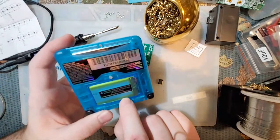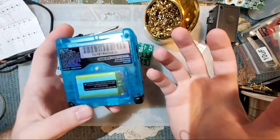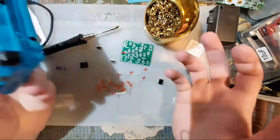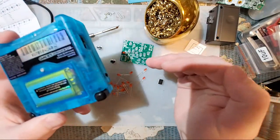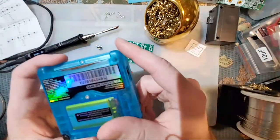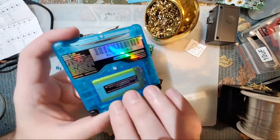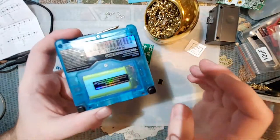Some battery compartments are just a little bit smaller than some of the others. It's a thing in manufacturing, and unfortunately, it's just how it is. Unless you spend significantly more money, tolerances are a thing you have to live with. Most of the time they're small enough that it doesn't matter, but in this case we have two things working against each other. The tolerances in the battery compartment being a little bit small and the tolerances on the battery itself being a little bit big.